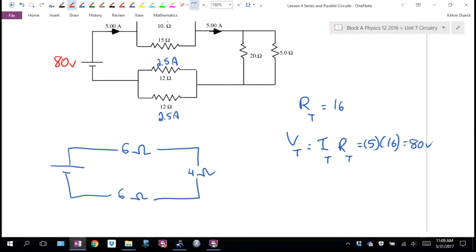So far, so good. We can do even more. Let's go back to our sketch, our mathematical equivalent. Put the 80 right there. How many amps are leaving this 80? Look at the original picture. So how many amps right there? Now you ready, folks? How many amps are flowing through this mathematical equivalent? So this has to be 5 amps. How many volts must we lose going through this mathematical equivalent?